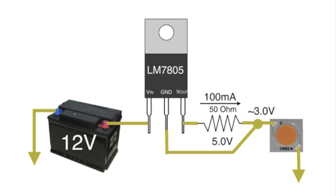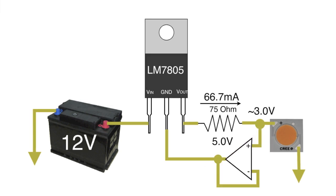Of course, if you need more current, make the resistor smaller. If you need less current, make the resistor bigger. The only gotcha here is that the ground pin will leak a little current — about 4 milliamps — and that can't be helped. But you can include that in your calculations, or use an op amp in a follower configuration to solve that problem.